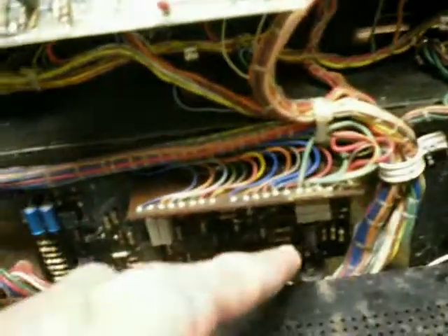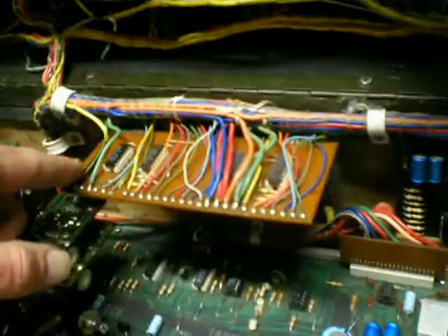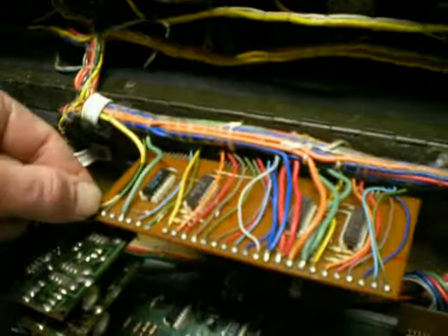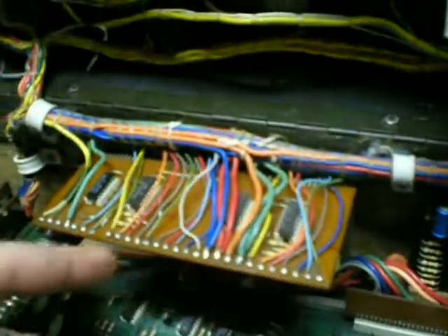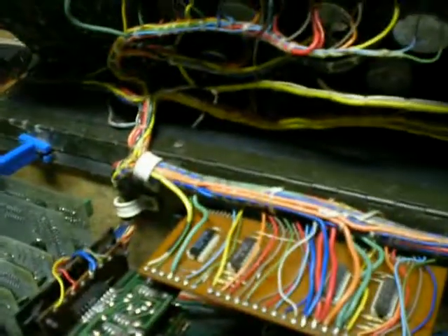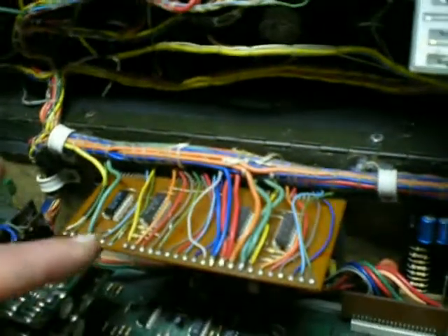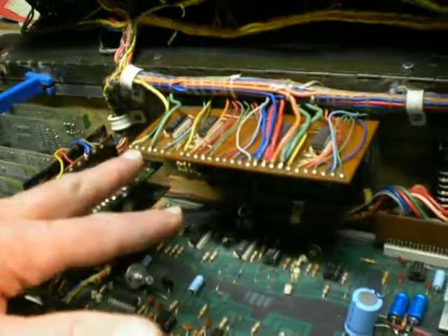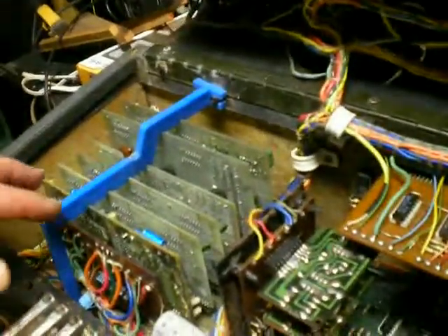That's your LFOs back there, and a card that is just an interconnect going into it — the LFO 1 and 2 circuits and the 4724 for the stair-step and random sample-and-hold are there. This is the interface to the card that generates the oscillations, the waveforms under there. It takes the high-frequency signals which come in — I think they come in that wire and that wire. You should see a high-frequency signal coming in from the card over here. These do the logic functions for which waveforms are being selected. Down on the board there, we've got the actual wave-shaping circuitry that steps the waves and adds them logically to create different waveforms, approximations of waveforms.